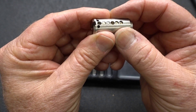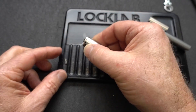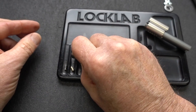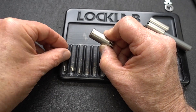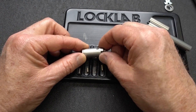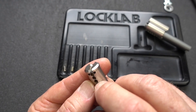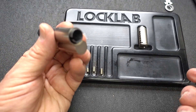It is a six pinner. I don't see any real weirdness. I see a couple of steel pins there, but nothing weird. Standard. Isn't that weird - nice cut on that. Standard. Standard. He was number six. All these are standard, guys - nothing weird that I can see. Completely stock. There were no anti-drill pins in that, which is kind of surprising in a supposedly brand new right out of the box lock. I guess they don't put them in all their locks - maybe it's a special order item.